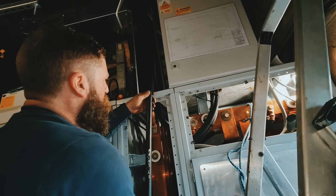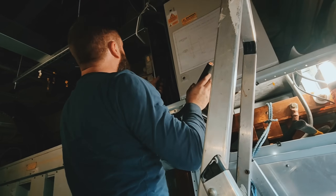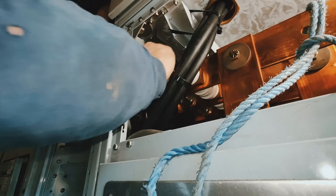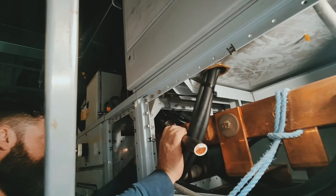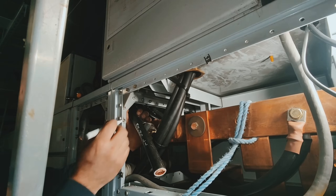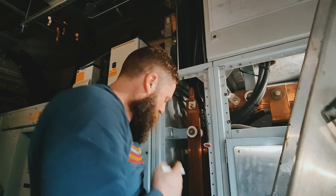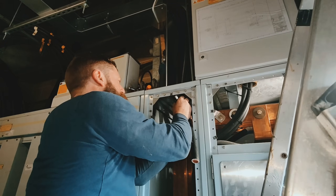I want to bend it outside before I put it in to make my life easier. And yes, I have over-egged the bend radius, but it'll all come out in the wash when I straighten it up. I should be able to get the mark without having to measure it properly, because we've got the space to do it - which is always nice. So this L1 goes into the bus bar chamber.